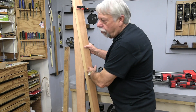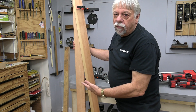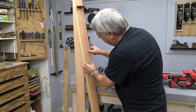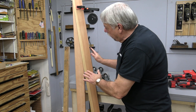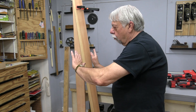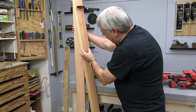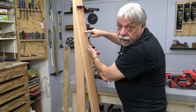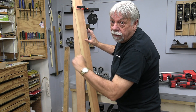Now I picked up this beautiful quarter-sawn, nice and dry fir, and it's perfect for this, but it's really overkill — I don't want to overbuild this thing. This wood is way thicker and wider than it ever needs to be. What I'm more concerned about is the racking. This is going to have some heavy clamps on it and I don't want it to rack. So I'm going to trim it down, but when I put the cross pieces on, I'm going to make sure they're nice and wide because they'll help prevent the racking of the whole stand.